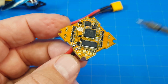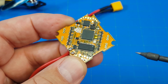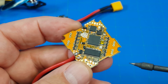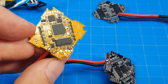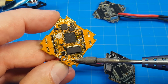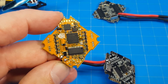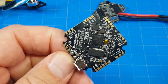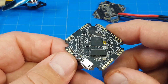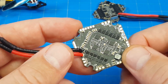But this is the Pyrodrome board. It also has a lot of the same specs you'll find on the Nameless RC and other boards — it's got a 2.5 amp BEC, which I think is good. The 5 volt rail is something that is oftentimes dying. This pad right here might concern you if you've got one of these Pyrodrome boards, but I believe this is ground — this little post off your USB port. It's fine to get solder onto that; it's all the same pad, it's all ground. I very much like this board. It's got a good smart layout, easy access for building purposes. I sure hope we find some ready-to-fly quads that come with this.